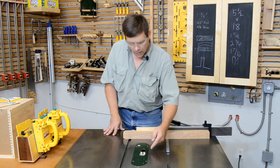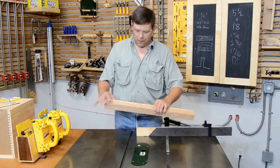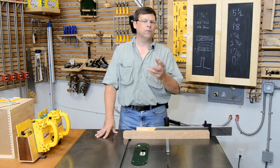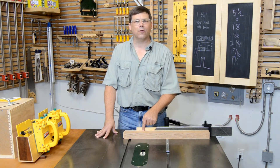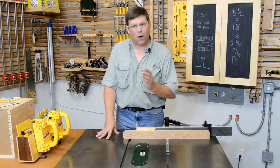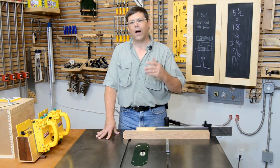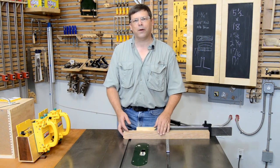Here I've got a triple bead knife set up in the molding head cutter. To be able to put a triple bead wrapped around a post or a leg or whatever you happen to be making is something that can be done on the router table, but requires a point-cutting roundover bit, which is not terribly common, and requires several setups — one for each half of the beads. So this would be four different setups: run the part, move the fence, run the part, move the fence, and hope that every time you've moved the fence you've gotten it exactly right. By using a triple bead cutter, I know that the profile I cut is going to be what's on the cutter, and so I can actually mill a set of beads running around a post anywhere in the center of the post using the molding head cutter.